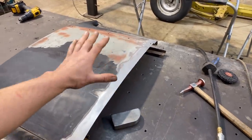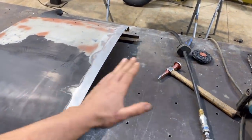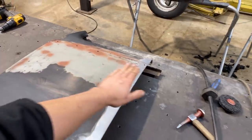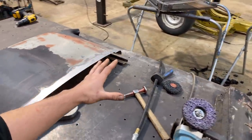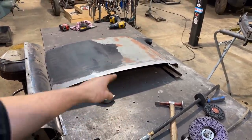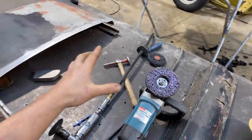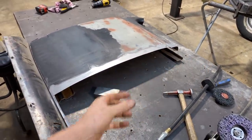Well, if you set these two pieces together, this piece and this piece, and you slide them together and we eyeball this body line all the way down and we have the profile with our profile gauge across the surfaces, if those things all line up, and I mean perfect, as perfect as you get them here is as perfect as they will be on the car. That is a fact.